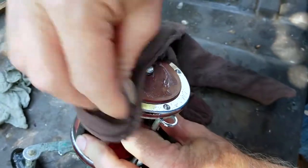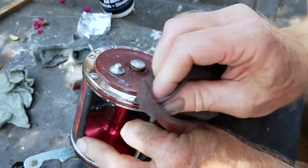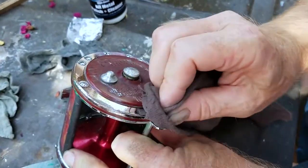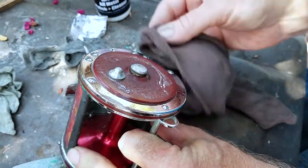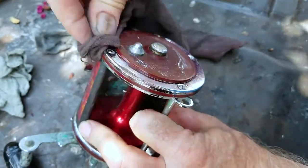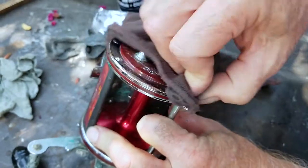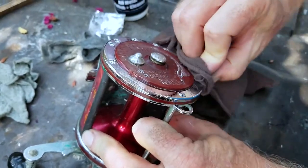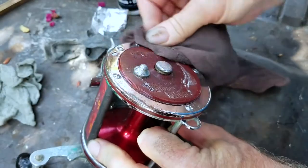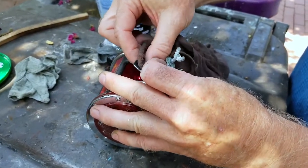Chrome is just a coating over the metal. If there are pores and imperfections in the coating, it lets rust and the parent material come through. That's what causes the rust and oxidation — little voids, pores, cracks, and chips in the chrome that let the iron particles form rust and corrode.